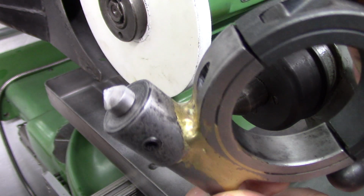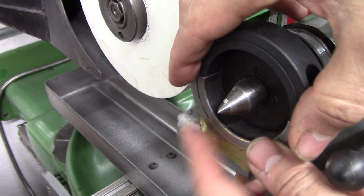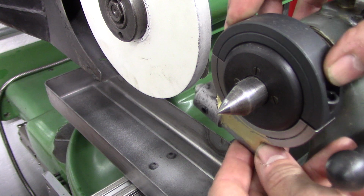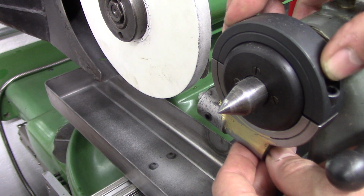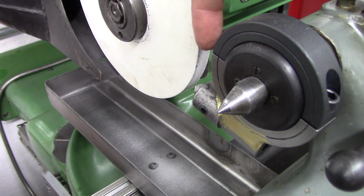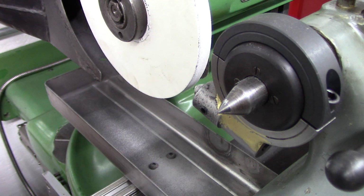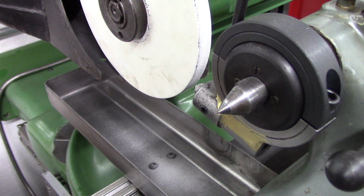Yeah, I'll spray paint it. But it takes a regular 3/8 diamond nib and just fits on there like that. And see, you can adjust the angle and the height to get the diamond where you want. I thought of putting it on center, and it really works better down below, because you always want to have your diamond at a bit of an angle. So that works great.